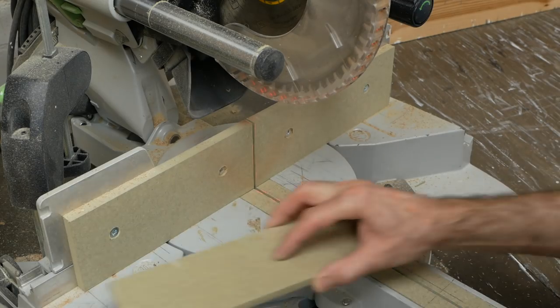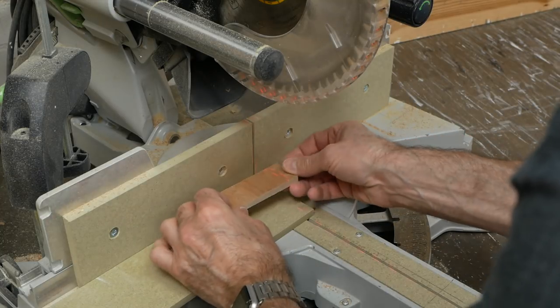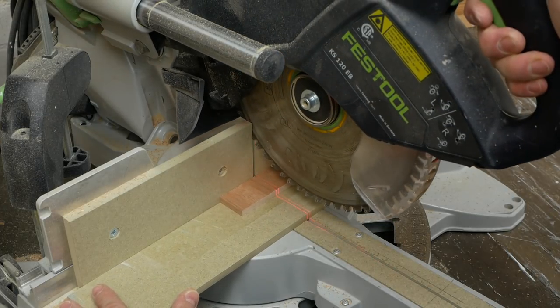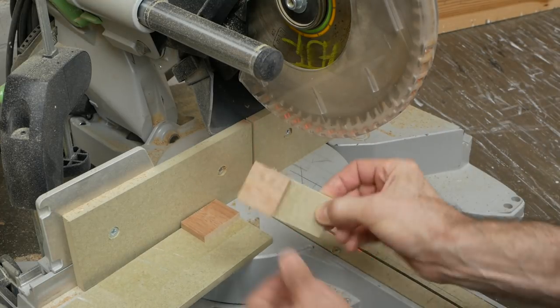The best way I've found to cut very small pieces on the mitre saw and chop saw — in fact I had to cut some recently for one of the gift ideas — is really really simple: you just use a backing board. Any old piece of scrap, I use a piece of 12mm MDF. Just run some double-sided tape over that, put your palm over it a little bit so it doesn't stick super strong, then use the mitre saw fence and stick your small piece against it. You've got plenty of room to hold the backing board while you make your cut.